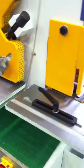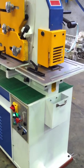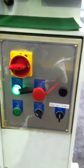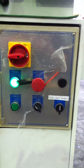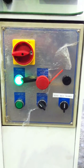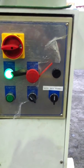On the back of the machine here we've got a rectangular notching station which also has adjustable guides and scaled rule inserts for measurements. On the control console there's simple on and off, Telemechanic high quality emergency stop switches, and due to being a single cylinder machine we've got the activation button for the punching and also the notching. You can work this machine in automatic, inch or normal mode. All the heights and stroke lengths are adjustable via limit switches.